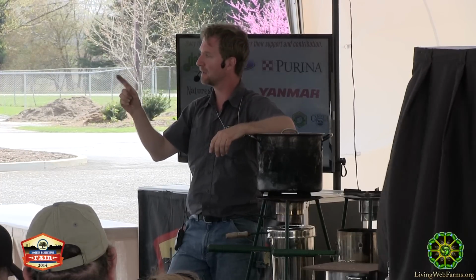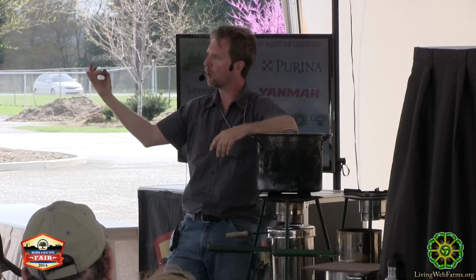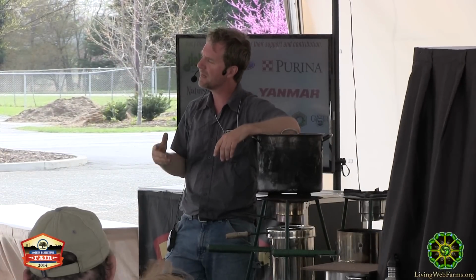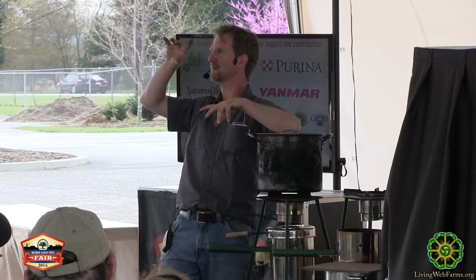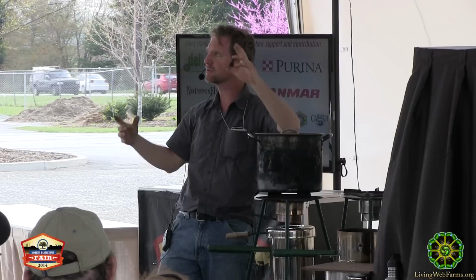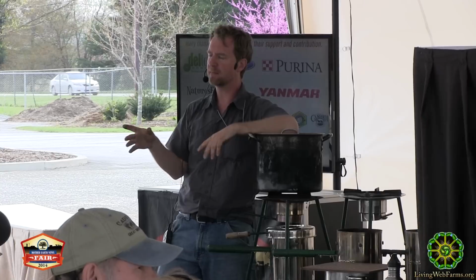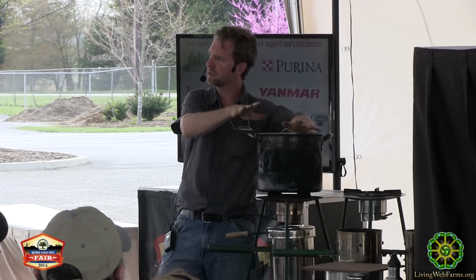And I said semi-sealed, that's very important. You have to have a port that opens, and like this gentleman is saying, that port could go to a compressor. A vacuum pump could pull it through a cooler and you could compress it. Wood gas does not compress as well as other things we are accustomed to compressing, like propane. Wood gas is primarily hydrogen and carbon monoxide. We're used to compressing gases like propane, which has 3 carbons and 8 hydrogens. It's a much bigger molecule. But that could be done, though that's not particularly this situation.